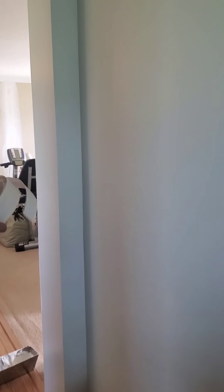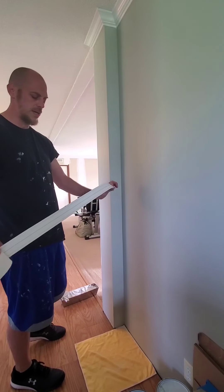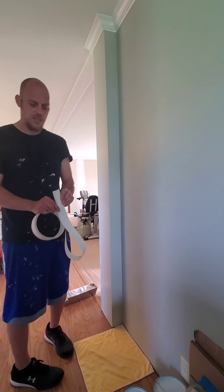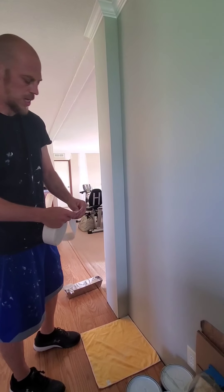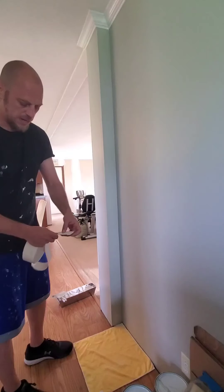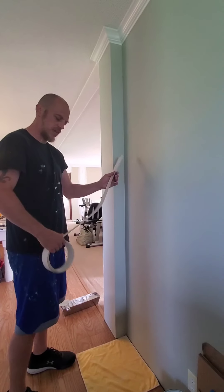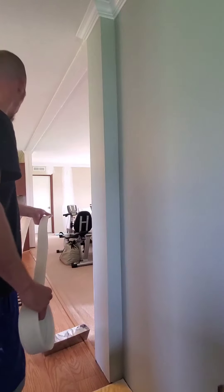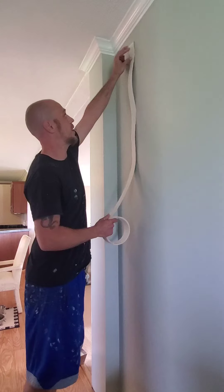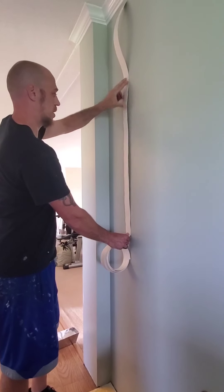When you get started, do not use regular tape. Do not use mesh tape. Don't use anything like that — these are perfect in a corner. A lot of corners in people's homes don't quite come together with the drywall, so this hard stiff backing will accommodate any gap you may have and help with air pockets. All you want to do is take this tape and dry fit it on the wall — run it down about like this, walk it down with your hand.